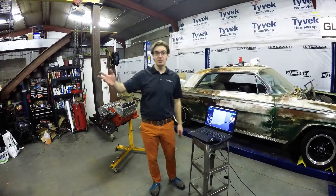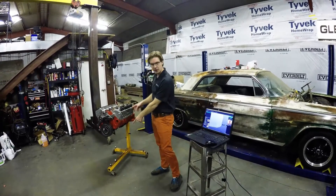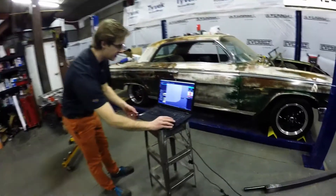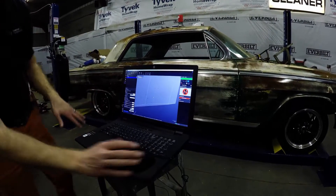The C-Track has finished warming up — it took about five to ten minutes. Now we just need to associate the C-Track with these targets and then we can start scanning. To do that we have the software; you can actually see in the software this is the volume, there's the C-Track out here, and this is what it's looking at — the whole volume it has — and those are the targets it's seeing currently.